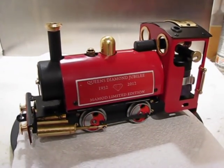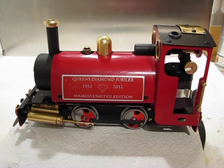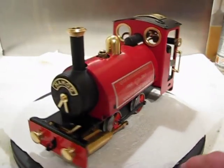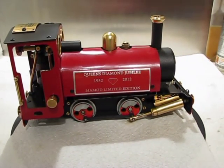The front of the saddle tank has one rivet each side holding it onto the front plate. Similarly, on the cab front, there is a rear plate which is riveted onto the cab front, and then the saddle tank is riveted to that plate by one rivet as well. Depending on how strongly these rivets have been compressed when fitting, this does allow for a slight misalignment of the bodywork, and I don't know the history of the running of this locomotive, whether it's had a lot of derailments, but certainly the bodywork is loose at the rear of the saddle tank on this side and can be pushed down. Really the cab body needs to be fixed to the cab floor to prevent that.